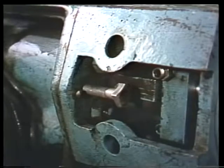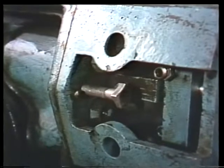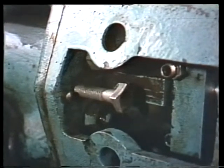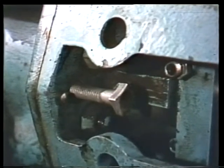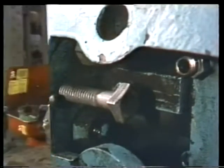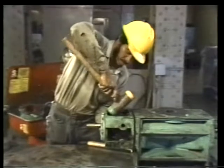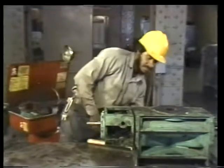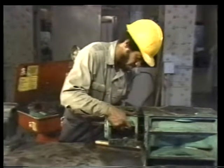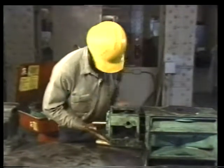You may have to use a pair of jacking bolts to separate the bracket from the casing. If so, turn each one about 1/4 turn at a time. This will ensure that the bracket is moved evenly. Whatever method you use, be careful when removing the bearing bracket not to damage the studs, the mechanical seals, or the shaft.